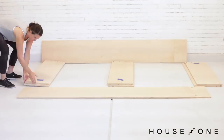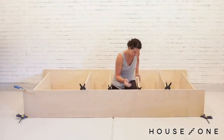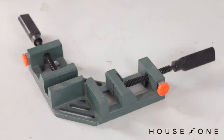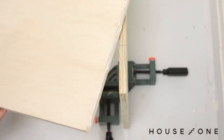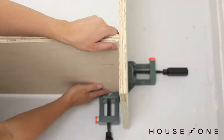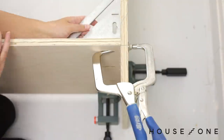I could now lay out the pieces with the shelving sitting between the sides. Assembling large pieces like this and keeping them square can be difficult — I recommend working on a flat surface and using corner clamps to keep connections square. To use a corner clamp, I set the side of the cabinet into the clamp, applied glue to the end of the shelf, positioned the shelf into the clamp, and adjusted the placement. I also used a pocket hole right angle clamp to keep the front edge of the board in place and then screwed the pieces together.